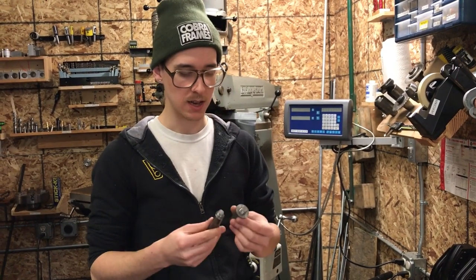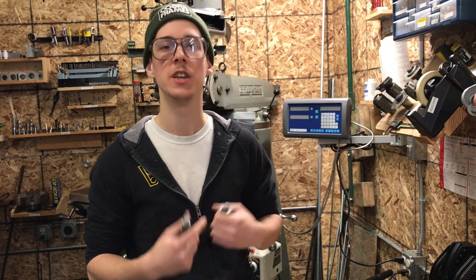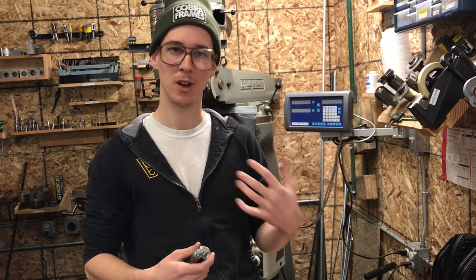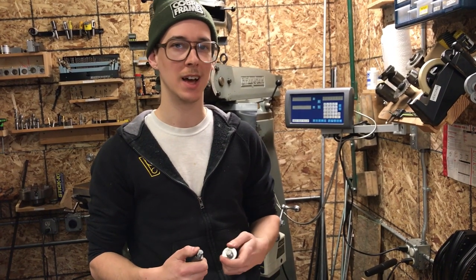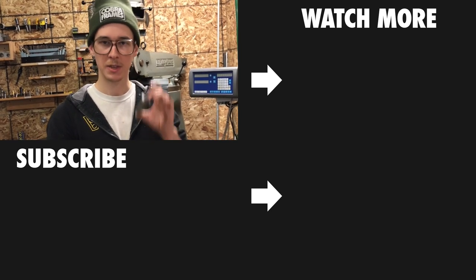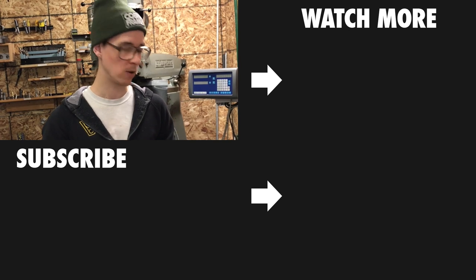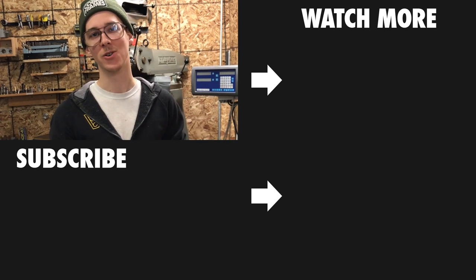The main points: you've got to have a lot of these arbors around — they're going to save your life because they produce really good cuts when you have the hole saws you want and the setup that works for them. You can get surprisingly good results on the cheap, and it's all about the setup and how you use them. Get yourself some of these Paragon arbors, or if you have a lathe and want a manual threading project, make a bunch of these. Either way, getting something stout that your machine can really grip with a collet and a larger diameter shank is going to get you the best performance out of these cheap little cutters. Hope you found the video useful — hit that subscribe button. Thanks for watching.